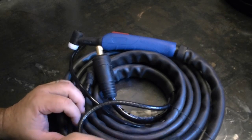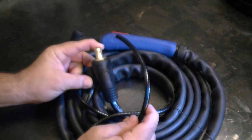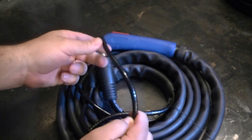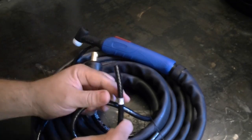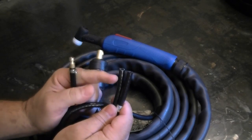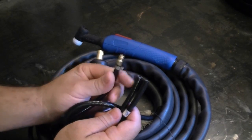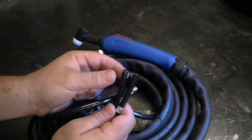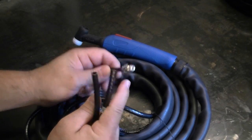This line right here is actually the return — the hot water coming from the torch that should go back to the cooler. The other line, which travels separately all the way to the torch head, is your cool water side, the pressurized water coming from the water cooler. Every torch may have the water fittings already installed, but if not they'll come loose and you'll have to install them. The water fittings look just like the argon fitting — they're the same connectors used for the water cooler quick connects. This is a 9mm quick connect.